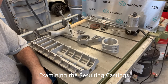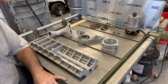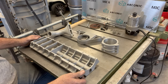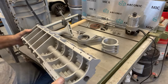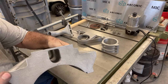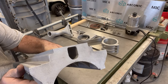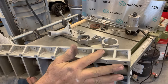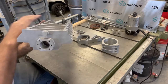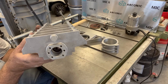I sneaked in a few more castings for the project. Let's take a look at that z-axis casting — I did some fairly light machining on it, drilled and tapped a pile of holes. I think there's 40 drilled and tapped holes in it. On the back side I machined a little registration slot in each side for the linear rail to register against, so they're nicely accurately positioned, parallel, and accurately spaced. All of those holes with the bosses had to be drilled and tapped on 60-millimeter centers to receive those 20-millimeter rails.